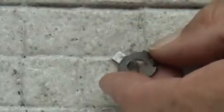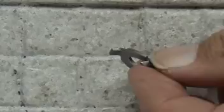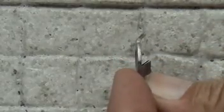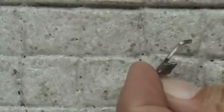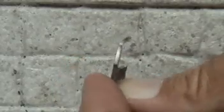The hole on these baffles is not circular but oval, and there's four tabs, two on the side, one angled at the top and a straight one at the bottom. The idea with these baffles, instead of being flat in the tube like that, they're at an angle. So you've got a series of 18 baffles like this, all lay against each other, all on the tilt.